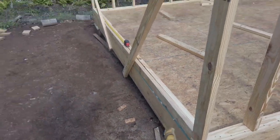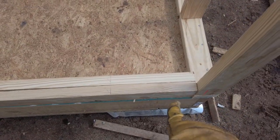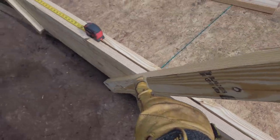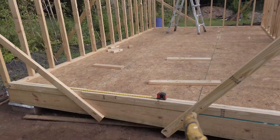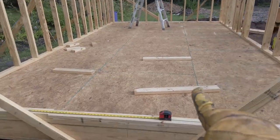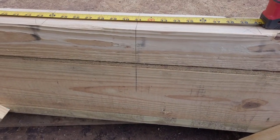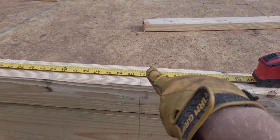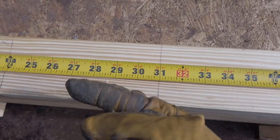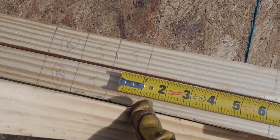Here is the final wall — I want a double door on the front. I hooked a tape measure on the outside of the framed wall and measured 16 inches on center all the way down. My double door I want directly in the center of my building. I found the exact center which was already marked from when I did the trusses, and transferred that mark up to the bottom plate and then over to the top plate. I want a 60-inch rough opening, so that's 30 inches each way. I burned an inch, so I set my tape measure at 31 and came over to 1, which is 30 inches, and set ahead.